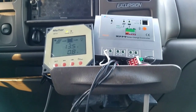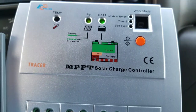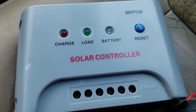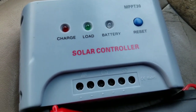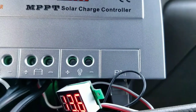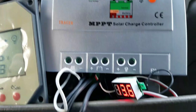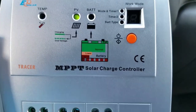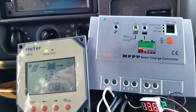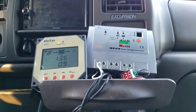Just in case you're interested, you can use just about any charge controller. I'm using an MPPT charge controller because it's much more powerful. I had tried another charge controller that also said it was MPPT, but when you would just open the door in the truck, the lights would pull so much power that the voltage would drop dramatically. When I set this thing up and did the same thing, the voltage didn't drop, which told me this controller is much more powerful and provides quite a bit more than the cheap charge controller. Good talking to you guys.